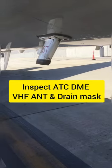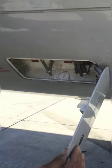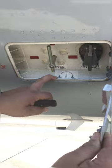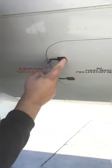As you walk around, we're also looking at the antennas. These are your ATC antennas, your water drain. Down here are your DME antennas — make sure they're secure because ramp guys or anybody can hit them and break them. All your panels, all your latches — make sure they're secure. This is your water fill and that's got to be in the locked position — locked to flight when it's at 90 degrees. The big deal is making sure we can secure the panel. Same thing with your toilet servicing — the latches have to be working fine.